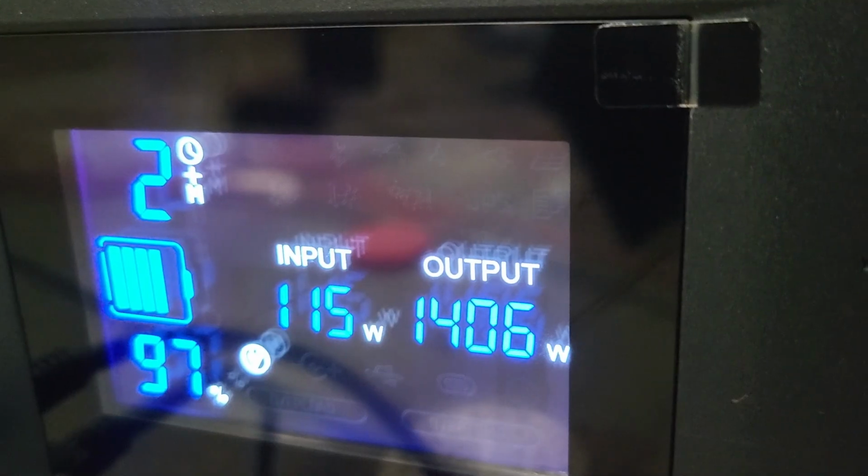I wouldn't necessarily recommend that, especially if it's their first power station or it's your primary power station, but it's something to think about. If you could get higher voltage, you can get more power into the device via the 5521 port. It has pass-through charging. It can be charged and discharged at the same time.